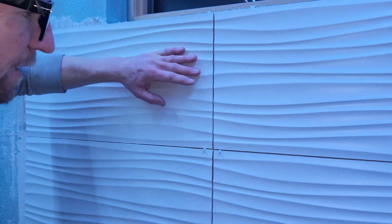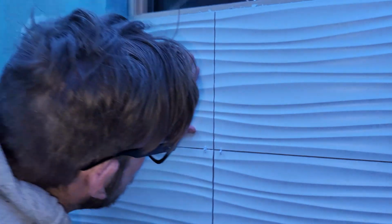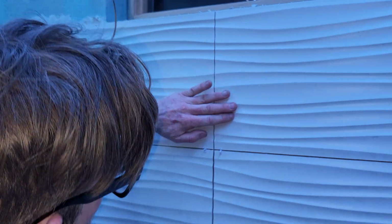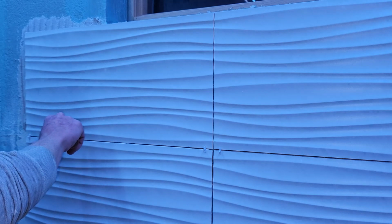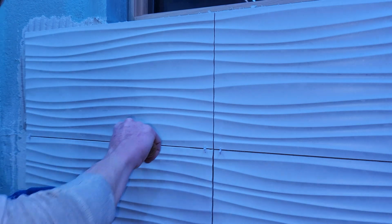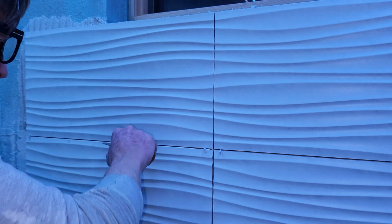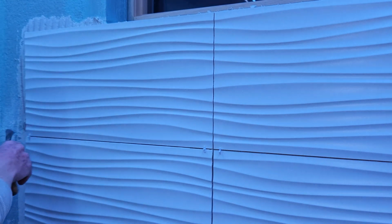Then edge your tile up, stick your spacer in over here on this side as well as this side here. Beautiful T. You can, if you want to, I need to scoot this over just a tiny bit. You can, if you want to, get your laser level out, but I had it out the other night and I got 3 rows beautifully done. And we'll just finish cleaning this up because I don't want any ridges that I have to chisel out or do this when it's dry. It just takes work out of the way when you're ready to grout after 24 hours of your tile being dry. Just setting this row has been a dream compared to my last batch of thin set.